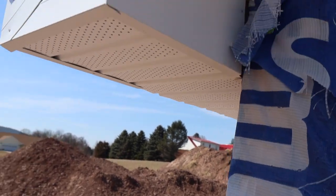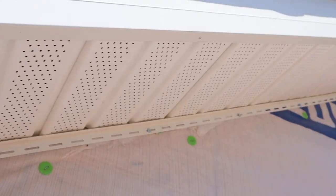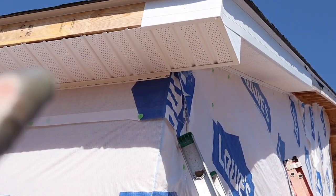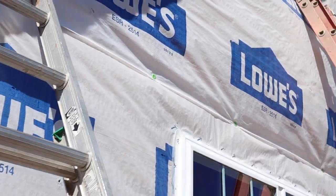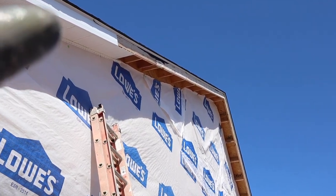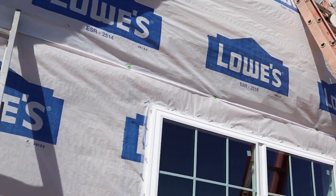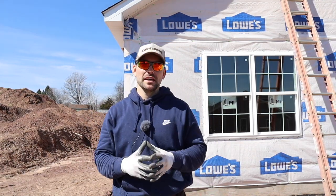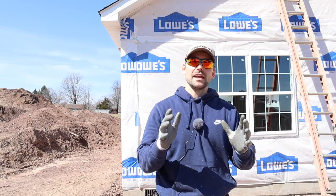That's how you install fascia over your bird box and overhang. Up close you can see the bird box fully wrapped in aluminum fascia and the soffit running up the gable end. To sum up: continue running F-channel, soffit, and fascia — overlapping each successive fascia piece by half an inch to an inch over the previous edge. Cut a 7/12 angle where needed, run it clear to the top, then start your fascia up the other way after running the soffit. That's how you install soffit and fascia. Thanks for watching — smash the like button, subscribe, and comment below what the most important thing you learned was.